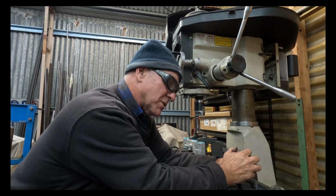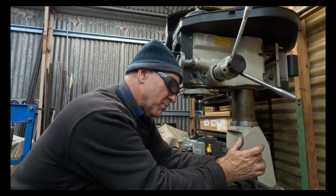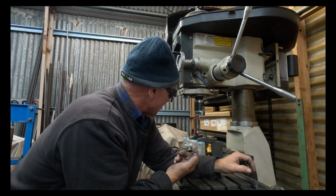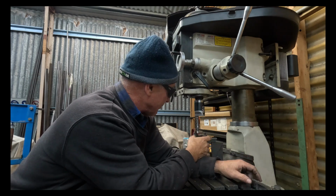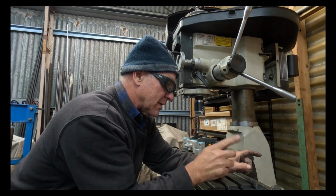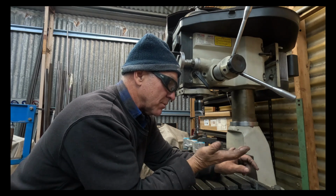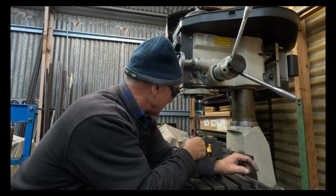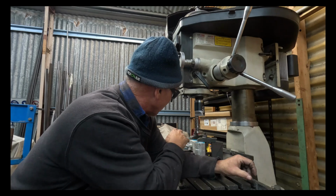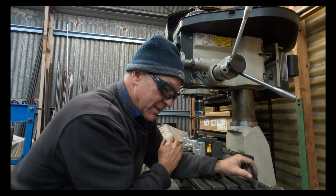So it'll match the Bantam head stem bearings, but I'll cut the metric thread on the end. So on the bottom triple clamp, I'll do a counter bore, and that shaft will be shouldered, so it'll press up into a counter bore in the bottom of this, and then the bearing and everything will stack on top. Anyway, that's enough of that. I'll go over and get this other one bored out.